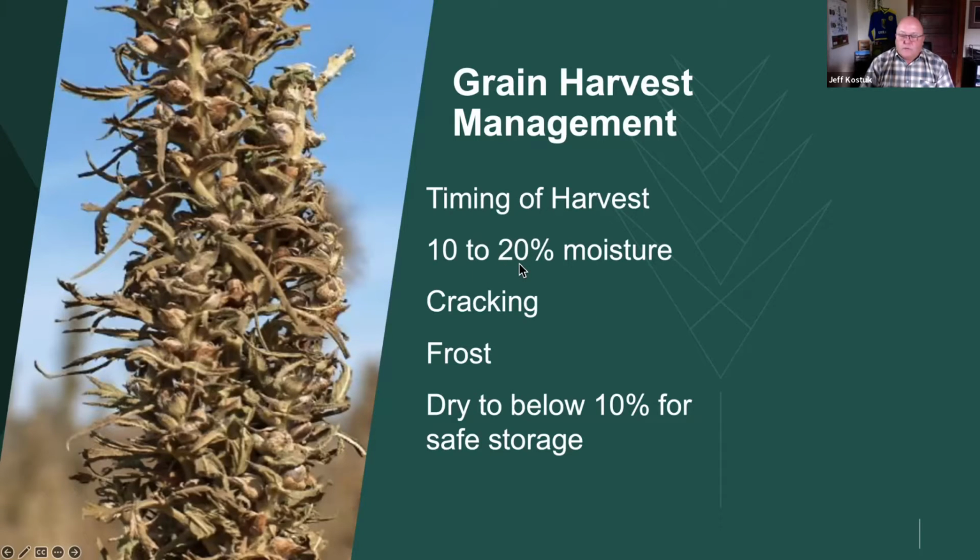Harvesting, I have harvested higher than 20%, but you really have a much tougher time having the separation within the combine. And you'll see that your sample is much more dirty. You just can't put enough wind to move that biomass that isn't seed, get it floating so that you can actually start to run the seed over the sieve and the chaffer of the combine. Hemp is also very sensitive to cracking, so you have to make sure that you have adequate spacing for your concave, whether it's a rotary or conventional combine, and the speed of that concave and or rotor or cylinder is quite important.